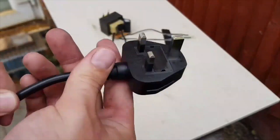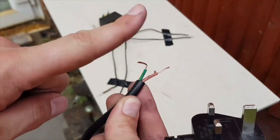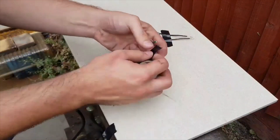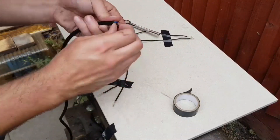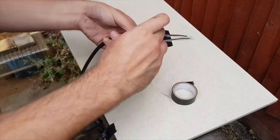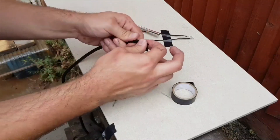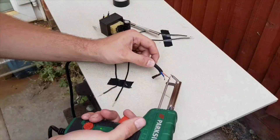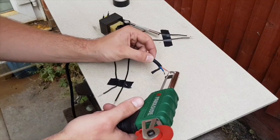With that done, we can move on to the power input. I'm UK-based, so I'm going to be using a three-pin plug, of which I'll only need the blue and brown live and neutral wires. The green and yellow earth wire can just be tucked out of the way — I'm just securing it with a little electrical tape and folding it back on itself. It's not harmful to keep it in place, just make it safe. Now I'm going to solder it to the back of the transformer, and that is our power input.